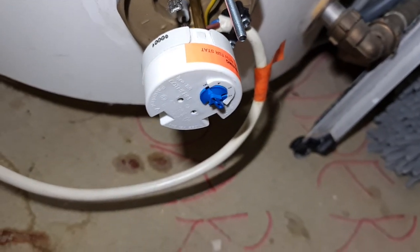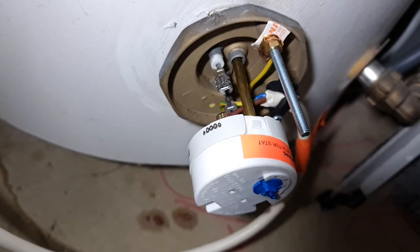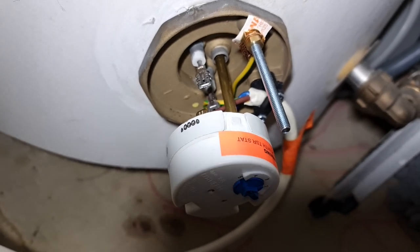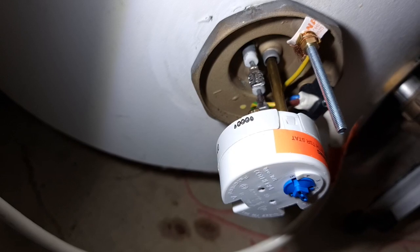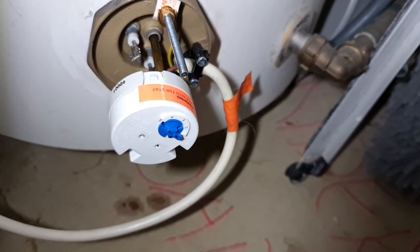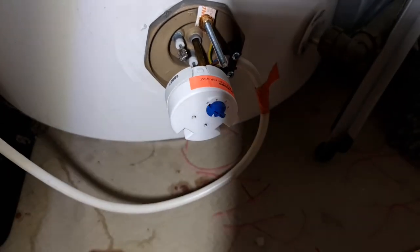The thermostat itself contains the wiring, so the only connection they would have to adjust would be the earth one. That could actually do with a crimped connector putting on there, so I'll do that before I go as well. And yeah, it should be quite easy for a heating engineer to do the maintenance on that themselves, but if we have to come back and check it over once it's in, we can do. But for the time being, that's back and working.